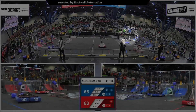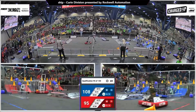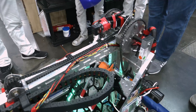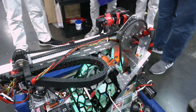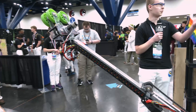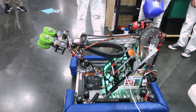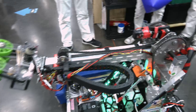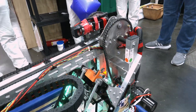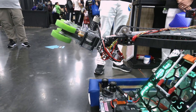Carson, talk to me about the arm process and something a little different you're doing with swerve. The kinematics of our arm were something we debated for about two weeks at the start of the season. We knew we wanted some sort of pivot — that was critical — and also some sort of elevator. The debate was whether we wanted a telescoping mechanism with an arm on it, or an arm with a telescoping mechanism. Ultimately we decided on an arm with a telescoping mechanism, as it simplified things especially with our wiring. Our telescope is a single-stage, designed in only a couple of weeks — it goes out about two feet and can retract, fitting entirely within our frame perimeter.